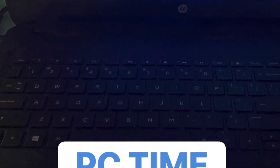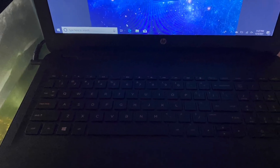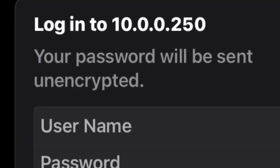Now it's PC time. We connect to the unit through the IP address. First we're going to have to download an IP scanner. This will help you find which IP belongs to your unit — the IP address is the computer address for that particular unit. Next you'll have to log in to the IP. The default password and username are root.